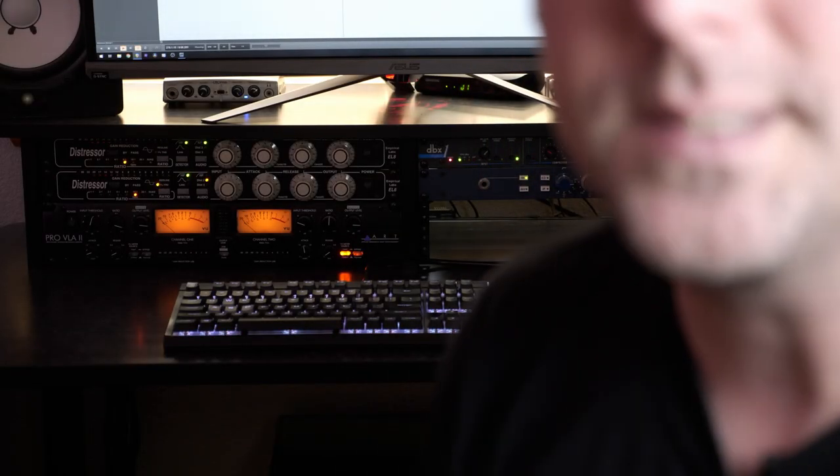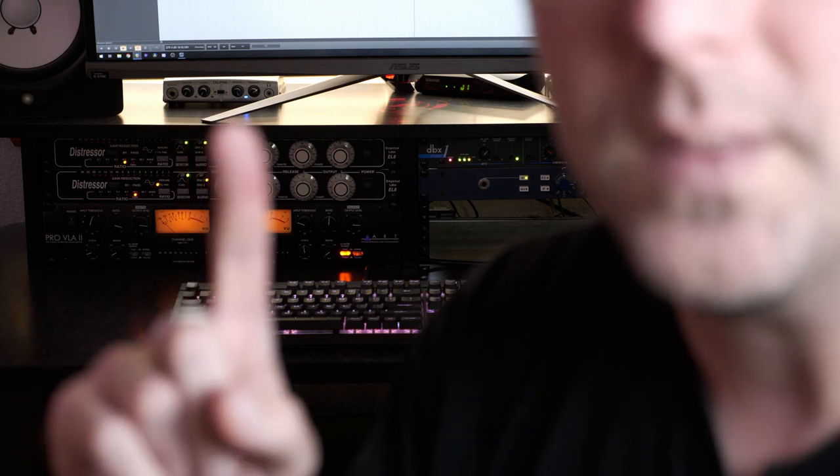The only other new piece of gear — hiding over there, you can kind of see it — is a Lexicon Alpha. I actually bought that to use just as a DAC, a digital-to-analog converter, for my gaming machine because I was having electromagnetic interference issues with my graphics card. I needed to get any analog audio connections away from that graphics card because it just emits so much interference. I wanted something with balanced outputs because with so many cables — power cables, signal cables, data cables — I just don't trust an unbalanced connection in that environment.